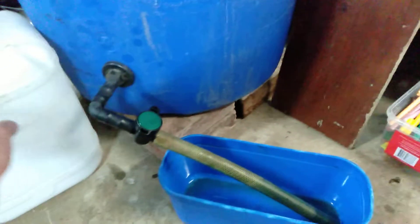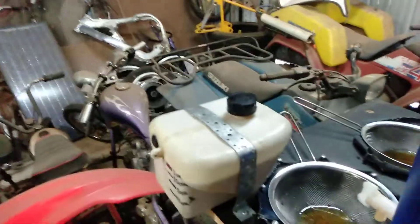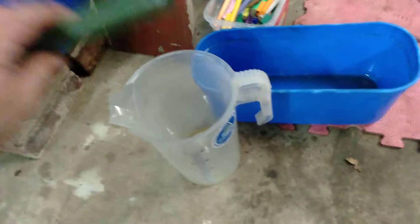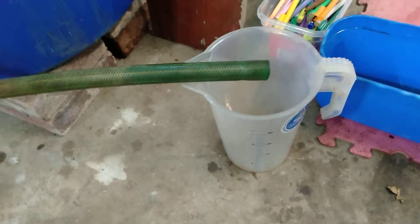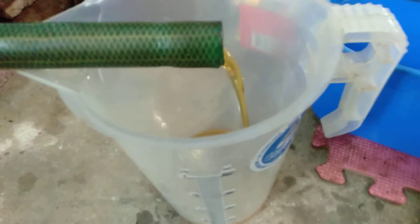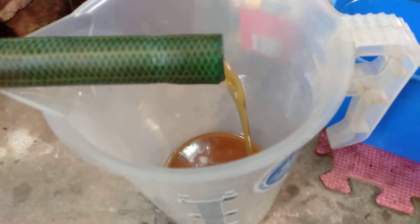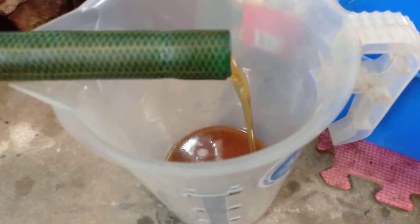Eventually that'll run into a big drum like this and I'll just pump it back up to another big drum. This will be replaced by a 20 litre drum, but at this point I'm just using one of these jugs, running only two litres at a time. Opening this tap, you can see that's the oil coming out nice and clean as it's been filtered by the sieves and the jeans, which are obviously the final stage at this point.